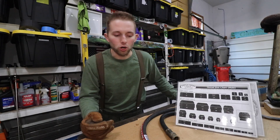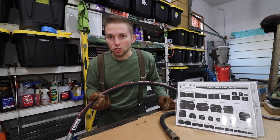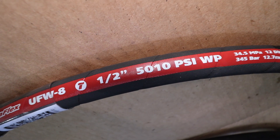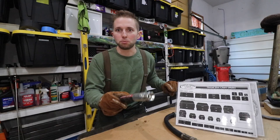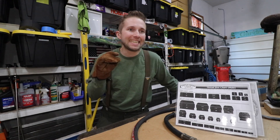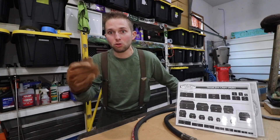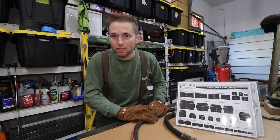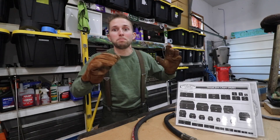If you decide to purchase a replacement hydraulic hose online, you need to pay attention to the PSI rating of that hose. The PSI rating on the new hose must meet or exceed the PSI rating on the old hose. If you purchase an underrated hydraulic hose, you risk that hose bursting. Hydraulic injection injuries can quite literally be a death sentence if you don't seek immediate medical treatment and find a doctor that really knows what he's doing. Do some research — it's very dangerous stuff. Hydraulics need to be built properly; you don't want to bubble gum and paperclip things together. Everything needs to be built correctly.